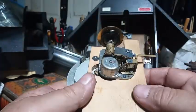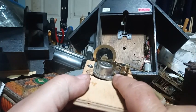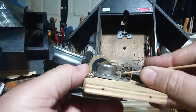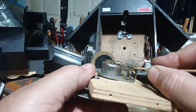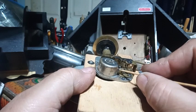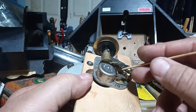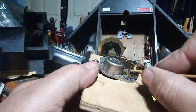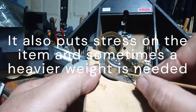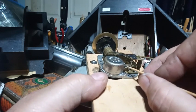The music box governor. A lot of the music box governors, this wheel right here that connects to the governor fan, a lot of them are plastic. And they crack. And when they get a crack in them, you'll hear a clicking noise as the music is playing. And that's because that wheel is cracked.